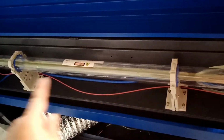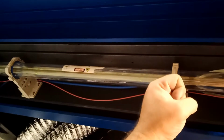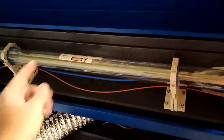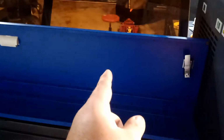So why do you open both of them, okay? Because this is glass, and if you're trying to drag this guy and this guy is tight over here, you're going to break that glass. So you want this guy loose and this guy loose at the same time. So you do your marking, you drag this guy, let's say this way, to fix. This will help you fixing, if we're talking about this axis here.